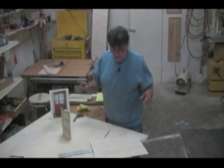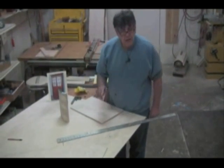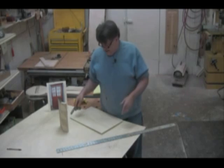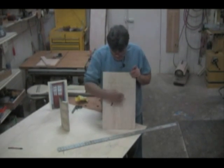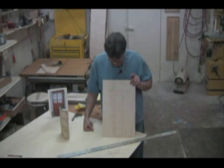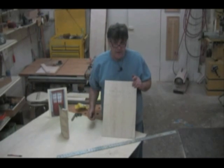That gives me an 18 3/4 inch raised panel. Now that's the exposed part. And it's going to give me a 12 3/4 width, same as up here. So just to show you that and see that, again I cut a piece and that'll make a nice raised panel. I've got good height and I'm in pretty good proportion here. It'll look nice. Then again, adding the 3/4, this will give me the actual size I need for my raised panels.